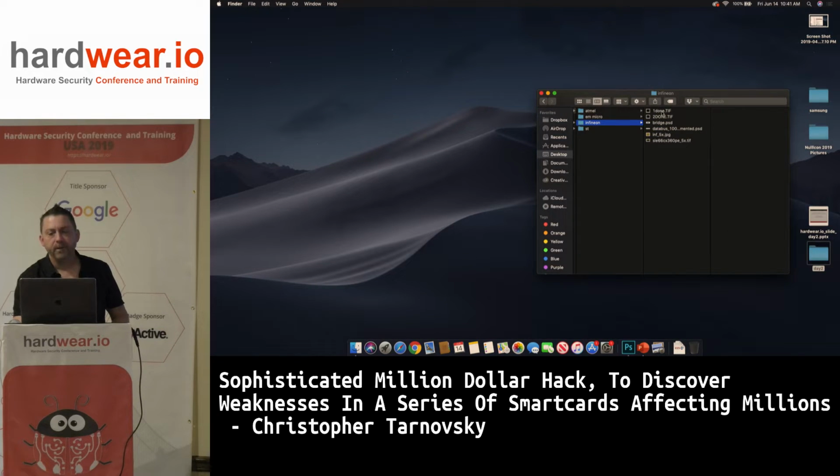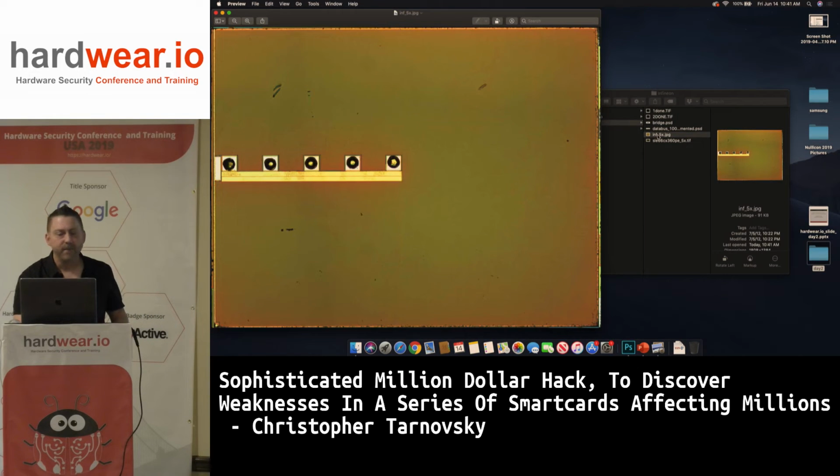So Infineon, I've talked about this, I beat them to death, but somebody wanted to hear about Infineon. So real quick, we'll go over some Infineon stuff. This is what a 66PE looks like. This is an old chip today. This is a 180 nanometer process. I believe it was 4 metal layers, with the shield.